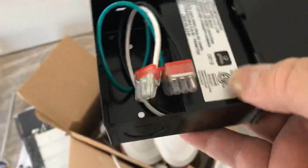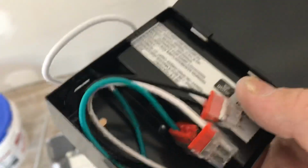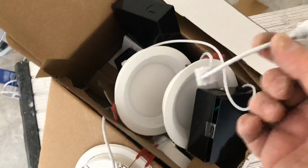All right, you open up this junction box. Let's see, okay. And you got a three-way. So you're gonna hook up a neutral from the main power, and then the other neutral goes to the second light, okay? And obviously the one that's on there will feed the light itself you're installing. And these you don't have to mount or screw into anything. You could lay it up inside the channel up there. You have this end here that literally plugs right into here. You know, your little switch. You just plug them right in, boom, and you're done.